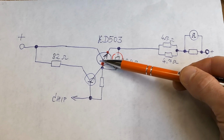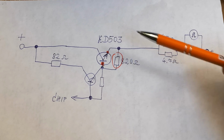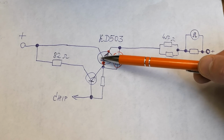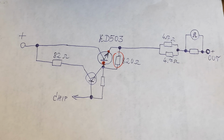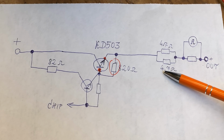And this definitely makes sense. When this power transistor is disconnected, then all the current tries to go through this resistor, and that's why it's overheating. It basically just goes through here and through this smaller transistor, and nothing goes through the big transistor. And also going through this resistance, the voltage drops to almost zero when loaded. And of course the overload lamp is never lighting up because the current through these current sensing resistors never exceeds 1 amp.